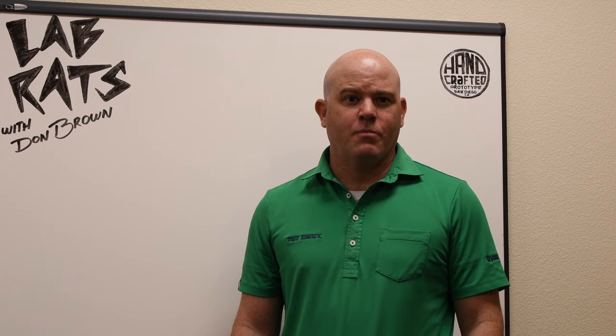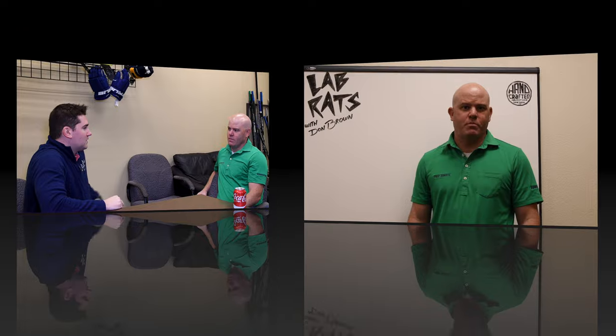Now that you've seen everything that goes into making one of our shafts here in our handcrafted laboratory, we're going to answer some questions you might have about materials and shaft properties. How long is the process actually from when the shaft design comes out of your computer to when it gets put into somebody's club? Usually I put my design sheets in the lab before I leave at the end of the day — around four or five o'clock. Technicians are usually in about 5 a.m., and if it's an urgent shaft, I can have the data and it can be ready to hit by about lunchtime — that's a raw graphite shaft with no paint. From start to finish with a new graphic, if we're really rushing it, we can get that out in about three days.